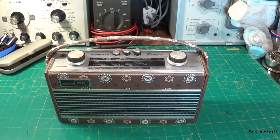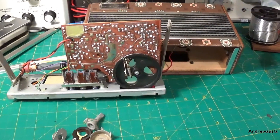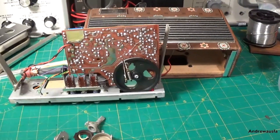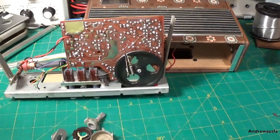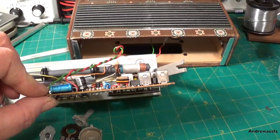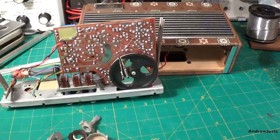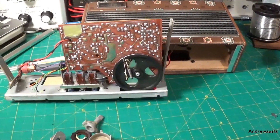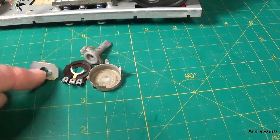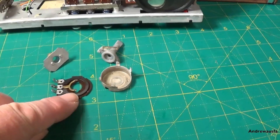I'm going to pop off and see if I can get this one working. So I've started working on this radio and started to fault find it — it's got very, very low volume, really really quiet. The first thing you suspect is the capacitor across the speaker. As I mentioned earlier, I had already bridged some of the capacitors with a brand new one and that hadn't made any difference. So the next obvious suspect is the volume control. And lo and behold, it is the volume control. We're going to take a closer look under the microscope — I suspect it might be these contacts here.